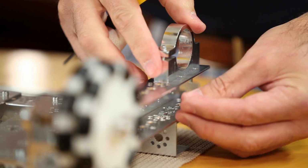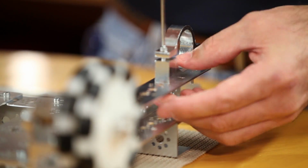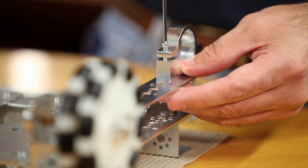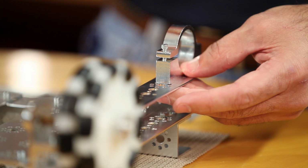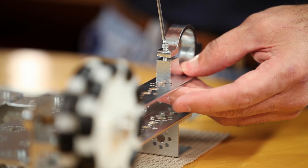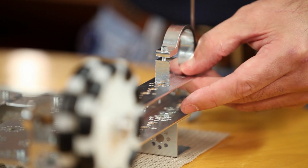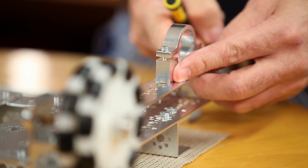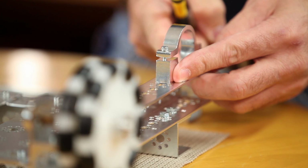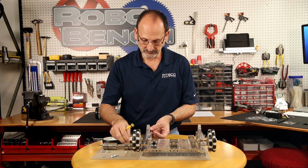And on this other side, I want to just go ahead and put the cap nut on, but I do not want to tighten it down at all, because as I tighten this side down, it's going to squeeze that together, which is going to make that clamp down on the motor. And we don't want to clamp that down until we actually get our motor mounted. So I'm going to snug this side down, make sure my motor mount is parallel along the center of my channel. And I'm going to go to the other side and do the same thing.